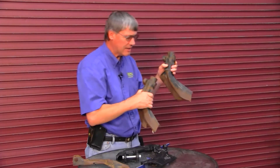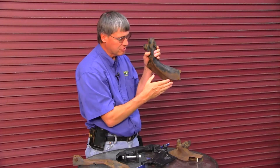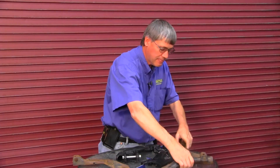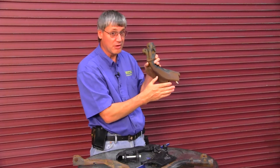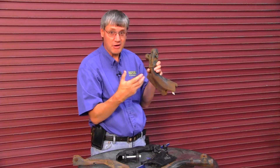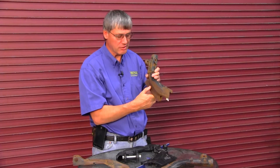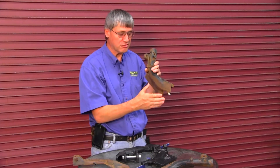The other part of seed boot wear is often a good indication of the health of the machine. You can look at where the wear exists on a seed boot and get a better handle on how much soil engagement or how well that boot is engaging the soil, because this boot came off the same drill as this one and both ranks were used at the same time. On newer drills like the 1990 CCS with a hopper in the middle holding 70 or 100 bushels, you're looking at four to six thousand pounds of seed weight, which often results in more seed boot wear due to greater down pressure on every opener in the middle section compared to the outside.